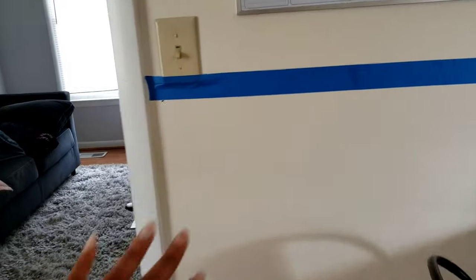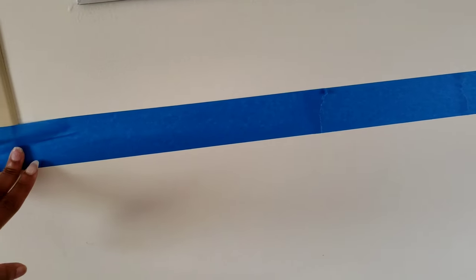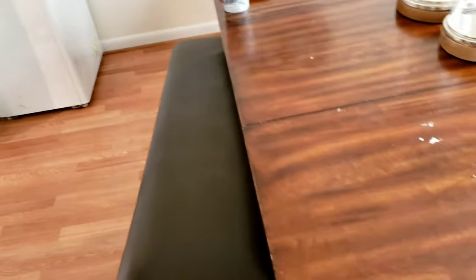My plan is: I purchased one by four, one by two, and one by three wood. The one by four wood is going to go across horizontally, and then the vertical lines going down will be my one by threes. I purchased one by two because the wood is going to poke out a little bit from the baseboard, and I do not want to go throughout this whole room pulling up baseboards. So instead I'm going to keep the existing baseboard, paint it, and install the one by two right above the baseboard so the trim goes flush with it and just looks like a decorative baseboard.